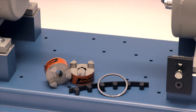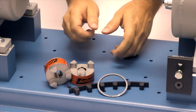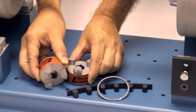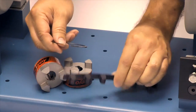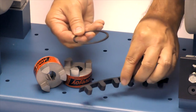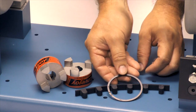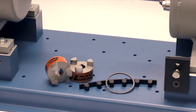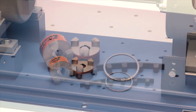The following components are provided with the purchase of your Lovejoy Snapwrap jaw style coupling. You should have two jaw style hubs, a Snapwrap spider with a groove for a retaining ring, and the retaining ring. Always inspect the components to ensure you receive the proper parts and review your application details to ensure that this is the proper coupling to accommodate your application requirements.